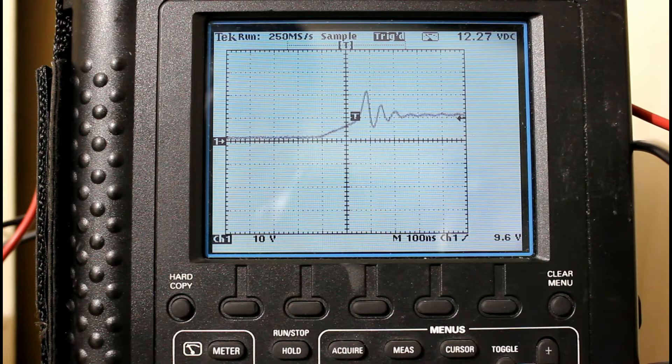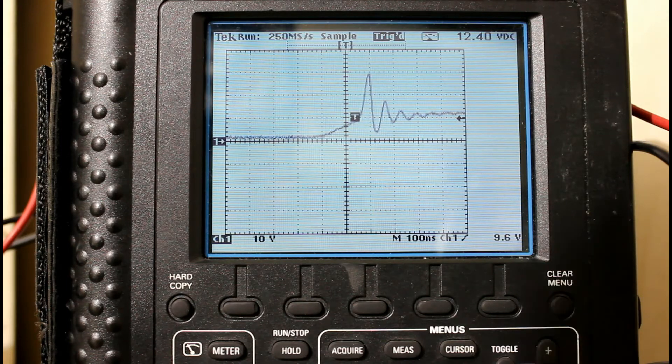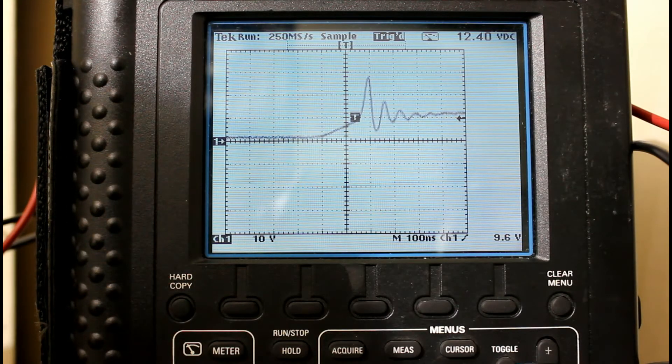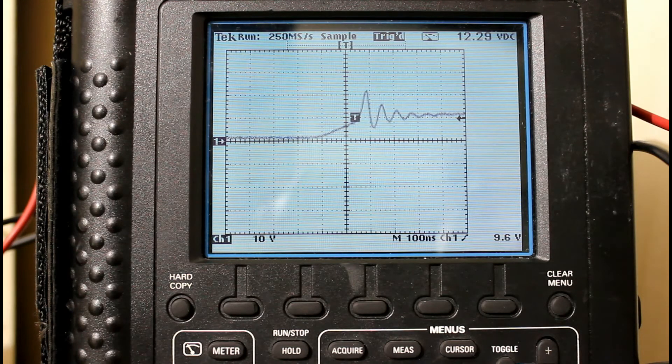In another video I'm going to talk a little bit more about the cooling of the IGBT module. But now I'm going to actually change the capacitors and show you what effect that has. So I've taken the 6,000-microfarad capacitor off, and it's just using the snubber capacitor now, which is 2 microfarads. That is getting a little bit higher. Adjust the timer a little bit — that's just barely on. And it looks about the same.